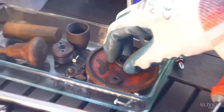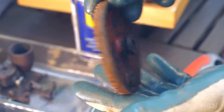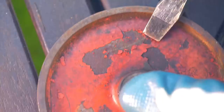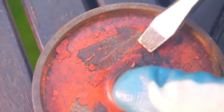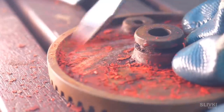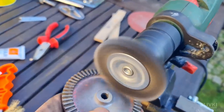Let's move on to probably one of the most complicated parts — the big gear that transmits the torque to the shaft of the drill. We use a wire brush to remove the dirt, and underneath we see old paint which we'll also have to remove because it's all cracked. Surprisingly, a regular screwdriver does a great job — apparently the paint is very old. We clean up the rest with the drill.